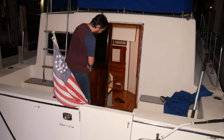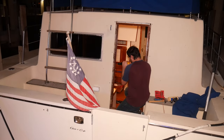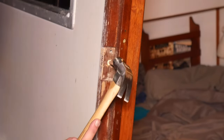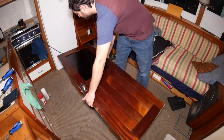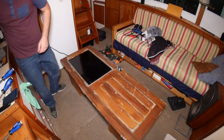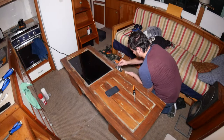So this door is falling apart. All the hinges — the screws just fell out of their spots. So I disconnected the last screw that was holding it in and brought it inside. I'm drilling out the holes that were there because I'm going to plug them with some dowels coated in some wood glue — just plugging up those holes to start fresh. Then I'm going to drill out those holes once it's all done and install new screws. I've never done anything like this. The most I know is from watching Travels with Geordi — Peter is great — but I don't have any hands-on experience, so I'm learning.